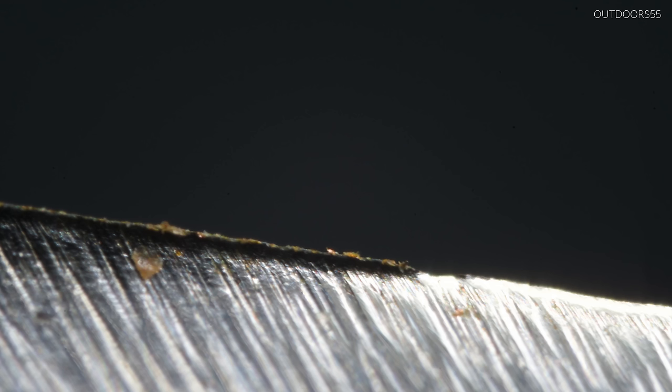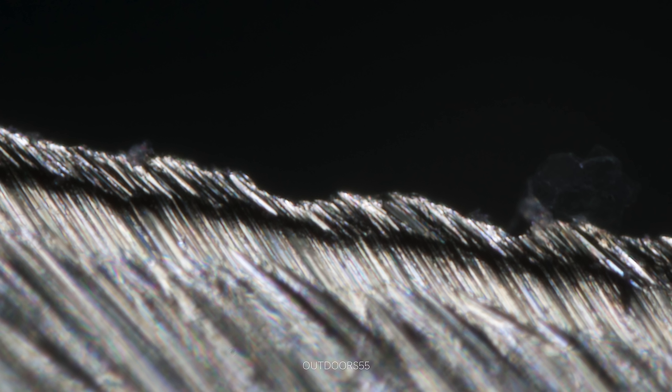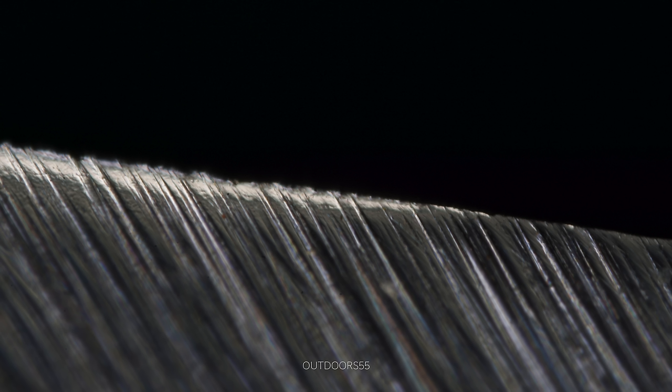Here's what that rolled edge looks like up close. On the surface it sort of looks like a burr, and I think this is where the confusion comes in. You'll often hear people talk about straightening the burr on the edge of the knife using a knife steel or honing rod. This is not a burr — this is actually the apex bent over. In comparison, a burr is much more irregular and rough looking, as opposed to the nice, clean, bent over apex.